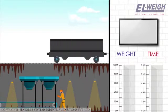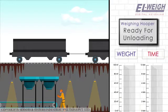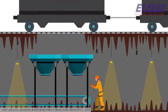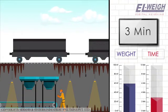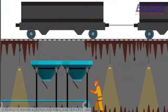When a wagon is placed above the hopper, if the weighing hopper is empty, the LED display will show ready for unloading. The operator can then open the bottom gates of the wagon and the whole material, approximately 60 MT, gets unloaded into the weighing hopper. This takes about three minutes. The system then records the material weight and opens its discharge valves.